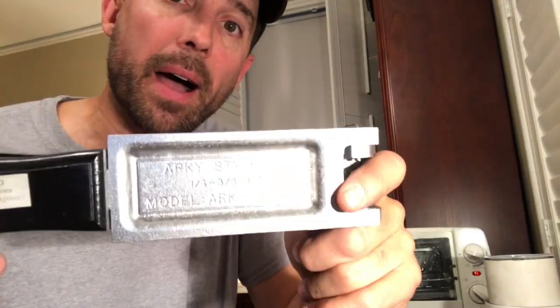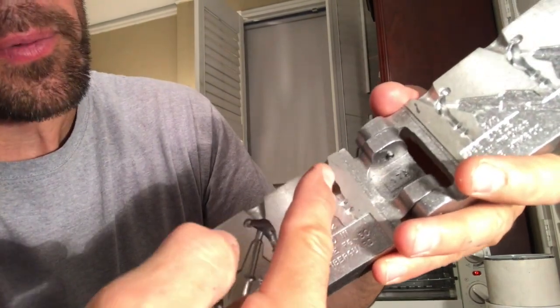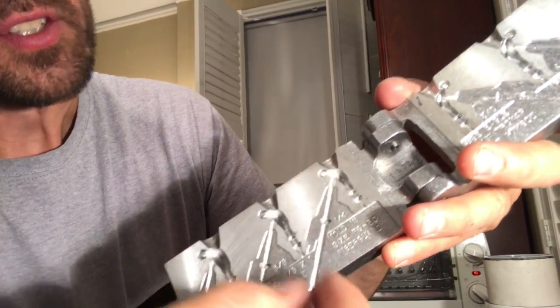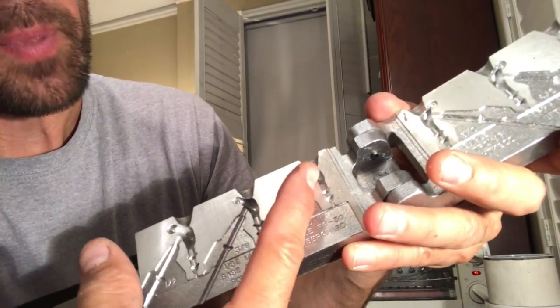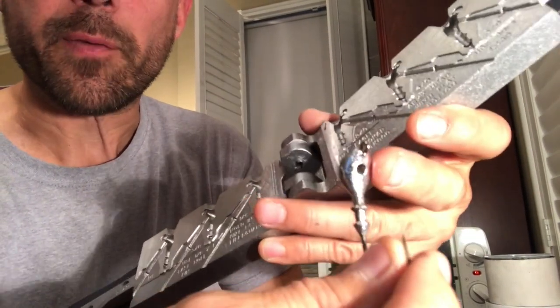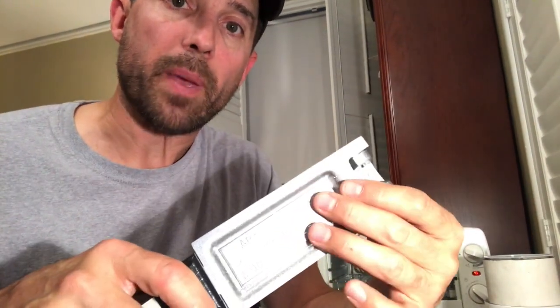One thing I will mention while the jigs are heating up is I actually modified my jig mold. The way I did that is I took a drill bit and drilled through here to a 9/64 diameter hole, so then I can take a 9/64 drill bit blank and set it in here, and the jigs come out with a 9/64 hole inside the jig head. The reason for that is the mold itself comes with 1/8 inch base pins.